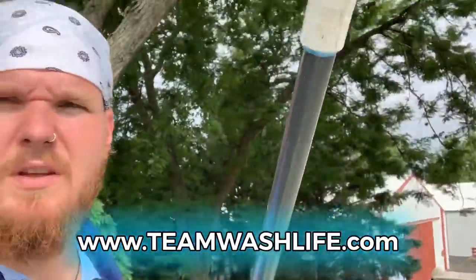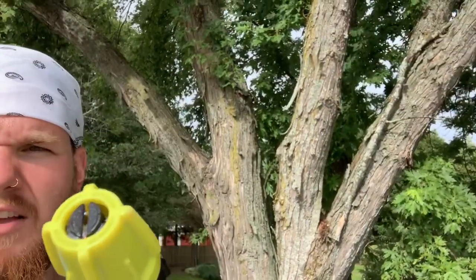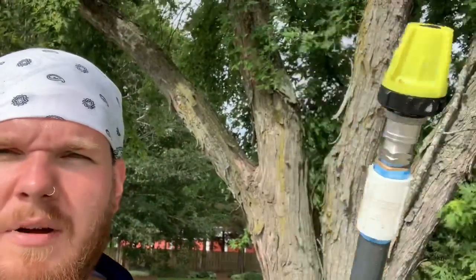We're gonna get to it using Mr. Sean Hodges roof pump in a box. Super nice little aluminum box. Comes with a Wash Life mixer, accumulator, 5.5 gallon per minute pump. Very simple, very basic, but it's all super tightly sealed and works great. Comes with 300 feet of hose, wand, and I love how he uses these things. I used to use these when I first started, but they actually work really well on the soft wash wands. I'm digging it versus the J-Rod.